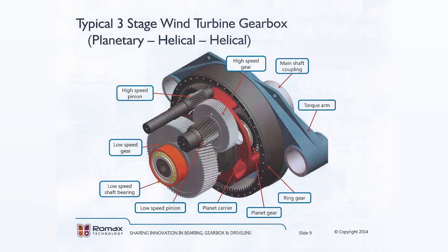Well, if you've watched the wind turbine at work, you might see that the rotor is turning only about 10 to 18 RPM. That's not too fast. The generator, one called an induction generator, needs about 900 to 1000 RPM to produce the turbine's rated power. So the gearbox functions to turn the slow turning high torque of the rotor into a much higher rotational speed for the generator.